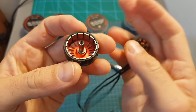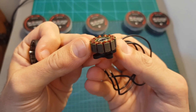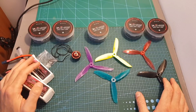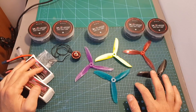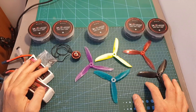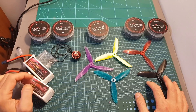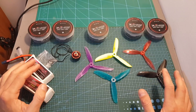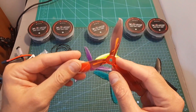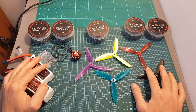The quality looks great, and it's not surprising because this motor is not cheap — it costs 20 dollars. I bench tested this motor on my motor thrust stand using 4S and 5S LiPo batteries and different types of 5 inch propellers, and the results were pretty impressive. I measured 1.7 kilograms of thrust using the 5S LiPo batteries, and I think I can measure close to 1.8 kilograms when using the Gemfan 5149 Flash propeller. So I'm really looking forward to testing this motor out.